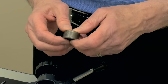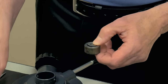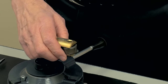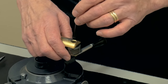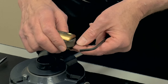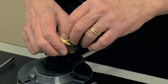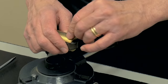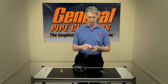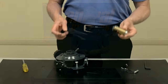Take your replacement feed roller bearing and line it up the same way. There are fiber washers on either side and pieces inside — get them all lined up. Carefully put them inside the carrier. I like to take the Allen wrench and put it down here because sometimes the fiber washers have a tendency to go off the reservation. Once you have everything lined up, put the shaft back in, hand tighten, and screw it down with your Allen wrench. Once it's back together, make sure it's rolling properly. Put the thrust bearing back on and re-insert.